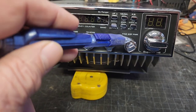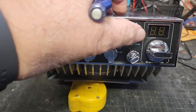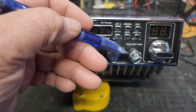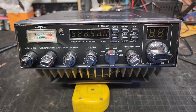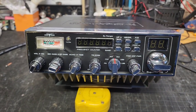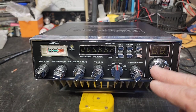Then we have a power high-and-low switch, and down here it says 'Fine' and 'RF Power' — I'm not sure about that. It looks like there's a button for RF power high and low, and then 'Fine.' I'm not quite sure if that's a misprint and this would be your fine and coarse clarifier, with the other being your high-and-low power switch. Something's not printed right. Then we have our channel selector, which is an encoder — not a switch. It's very flimsy feeling; it doesn't have those good solid clicks.